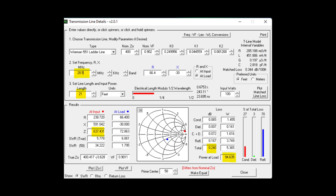That ladder line goes into a 1:1 balun, then into a tuner with a very short bit of RG-213 with negligible coax loss before it reaches the tuner. So the ladder line itself has about 0.2 dB loss on 10 meters — not surprising at all, since it's a resonant dipole on 10 meters at the end of the day.